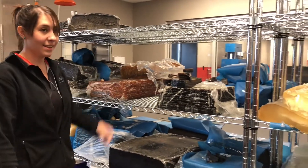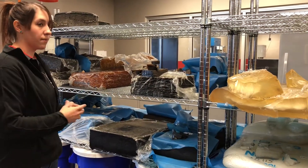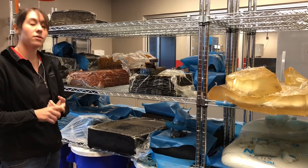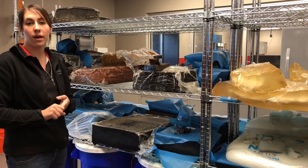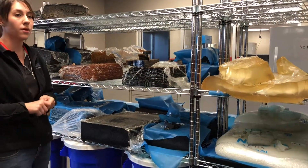But the polymer itself — how many different kinds of polymers are there? Everything different here: SBR, styrene butadiene. You've got regular butadiene, you've got natural rubber, butyl rubber — all different structures of the same kind of rubber.